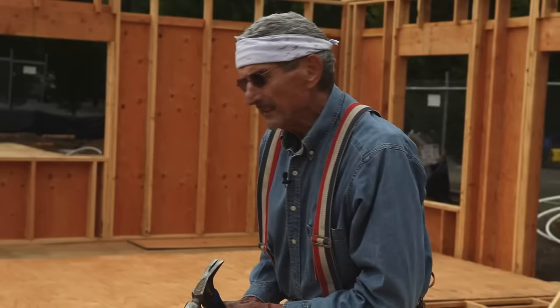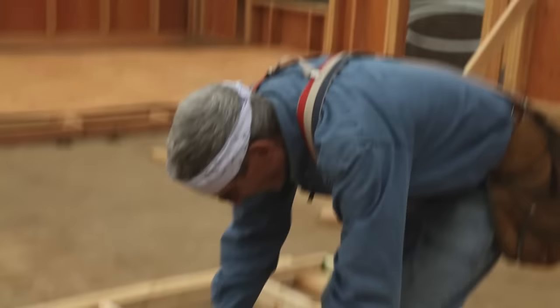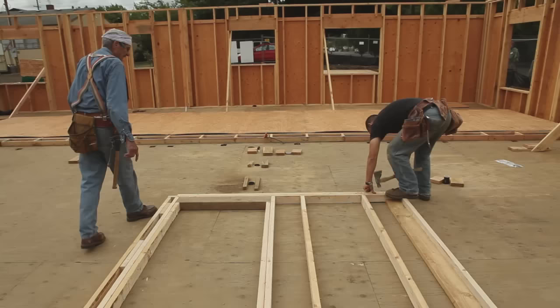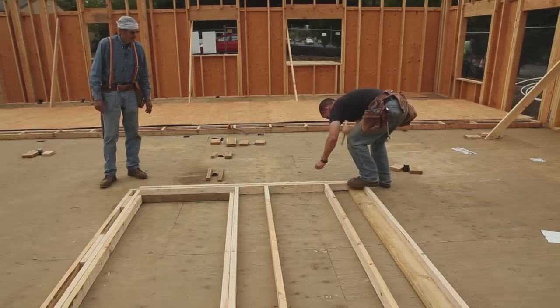Now we've got the trimmers cut. You cut them four or five and a half inches short of your wall stud. Some people nail these trimmers in hard right now, but here's another way to do it — you put one nail in it, right in the center. Then you nail on the double top plate, and that's what Scott's doing right now. It's important to nail over the stud so there's a clear passage for an electrician or a plumber.